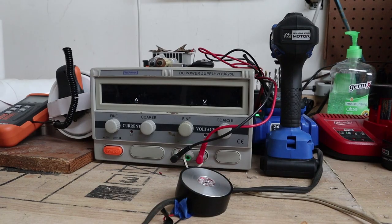Now that our epoxy's cured, we need to hook our puck up to the bench power supply and see how much current we can run to this that's sustainable with this amount of heat sinking. Since we're 3 series on this, I'm thinking probably 350 milliamps is going to be the right spot.